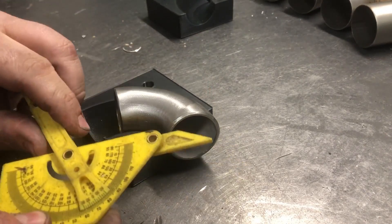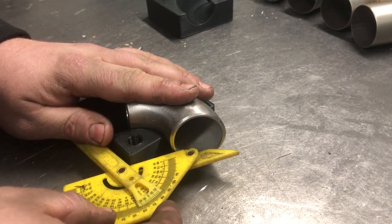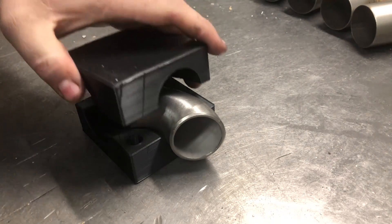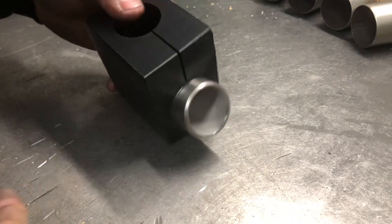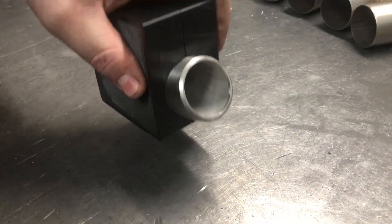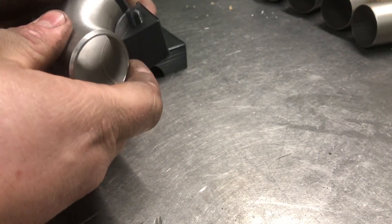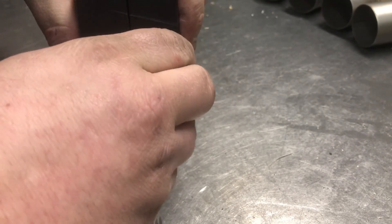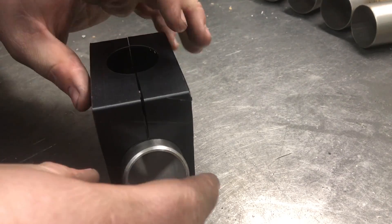You measure it from here to get your angle, rotate it as needed — so what we've got there is roughly about a 30 degree angle. Get a pen, obviously you've put both parts on, mark your cut, go over to your bandsaw, stick it in your vise, line it up, clamp it down — that's it. Because of the cut radius, it's not going to twist. Once that's clamped in there, it's not going to rotate around itself, so you're going to get a nice clean cut through the centre line radius.